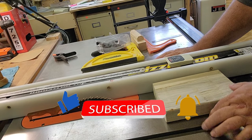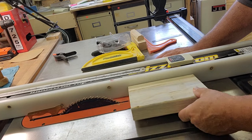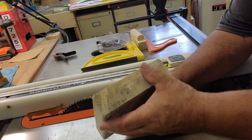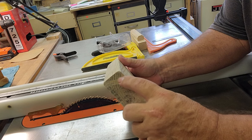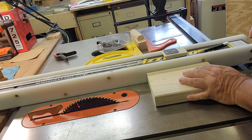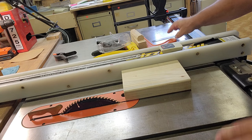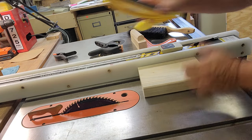Okay, here's the table saw. It's all made out of these scrap pieces of 2x4s, 2x6s. We should have enough to make three different wheelbases for this train. The first thing you want to look at — if you look at these 2x4s and 2x6s, you'll see the edges are always rounded. You need to cut that off so you have a nice straight edge on the board. All you're going to do is move your fence and trim off that edge. We'll get that trimmed off and head to the next step.